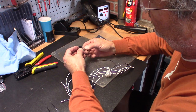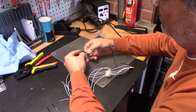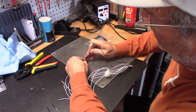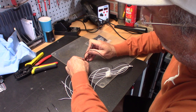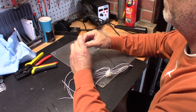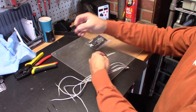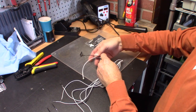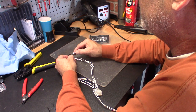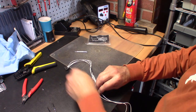Now we're going to install our pins on the very ends of our pigtails onto our battery external voltage sensor. And they're very similar, only this time your negative goes to the far right, and then it will follow in place by pins 1, 2, 3, 4, 5, and 6. Now, since these leads are a little bit longer, as we go, I've been wrapping the leads around the last lead, and we'll shove in our final lead, and that'll be that.